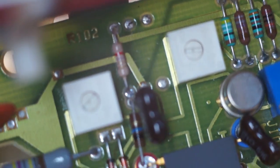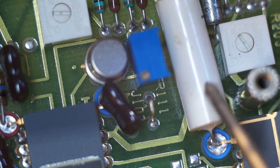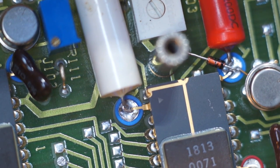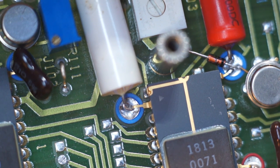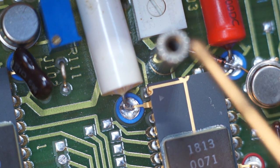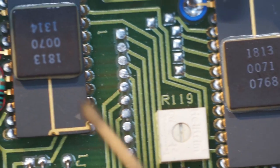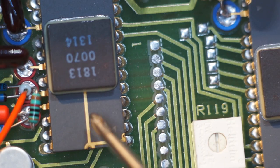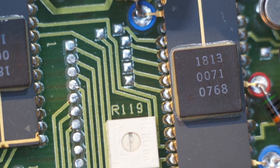More diodes. The structure on this is really beautiful. There's a J10. That's going to be a capacitor, presumably for integration. You've got more. These are all like 8-pin packages. I can't really make out that. Here's a little standoff. So you can see these are really specialty ASICs, and it looks like they've got a hand epoxied cap on, because you can see that their epoxy looks to have been hand applied.